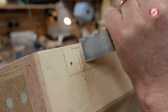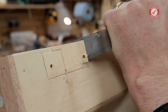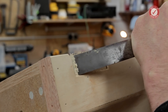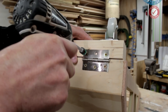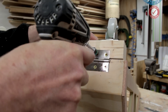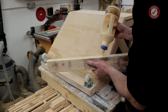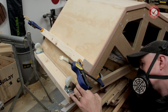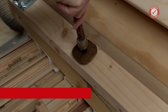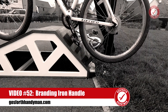I used a sharp chisel to cut out the rebate for the hinges. If I was doing this for a customer I'd probably use my palm router since it's faster and neater, but I couldn't face any more dust on this project — using the chisel is a lot less messy and a lot more satisfying. I then add bumps onto the back section of the ramp, which are just glued and screwed in place. These serve a number of uses: they're great fun to ride over on a mountain bike either up or down the ramp, and they also protect the wheels from accidentally being ridden onto — if you catch one of those little wheels you're going to know about it.